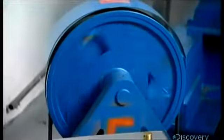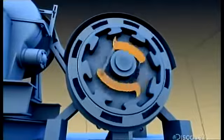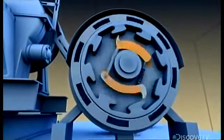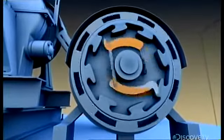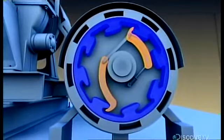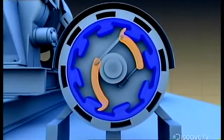There's a governor located beside the motor, with its own pulley and separate cable attached to the car. There are 2 spring-loaded metal hooks called flyweights inside the governor. If a car free falls and the governor spins too fast, centrifugal force pushes the hooks out. They seize ratchets on the fixed inner rim and stop the pulley. The governor's rope jerks on an arm on top of the car, and this locks the brakes.